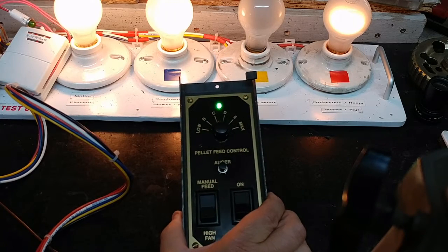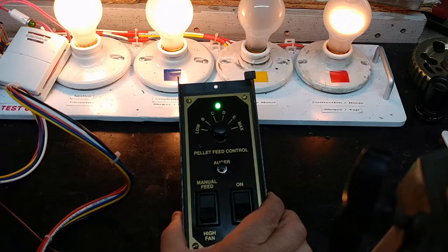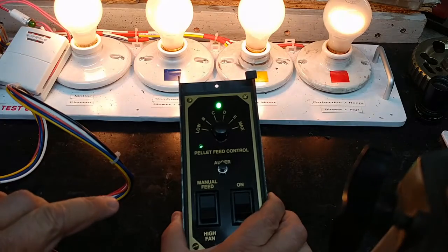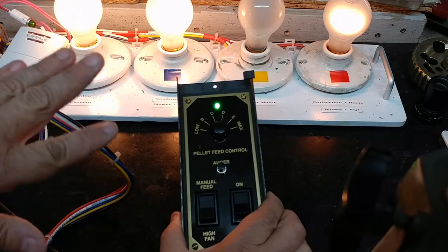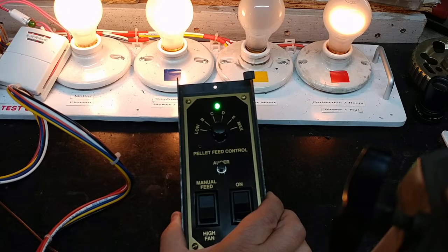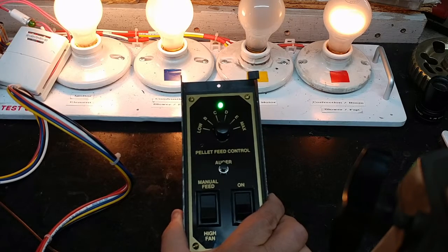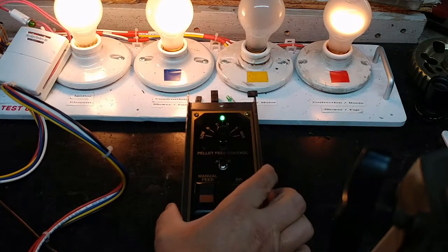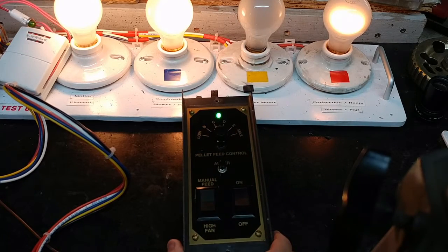So with all this, Matt, your controller is now working correctly. I will say one more thing: if I leave it in this mode for another approximately 10 minutes, this light, the igniter, will go off. I've already tested that. That is fully functional. That's a little bit outside the scope of this video. I don't want to wait that long. But this light will go off. That's a safety feature, and that indicates that the controller will turn off your igniter.